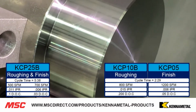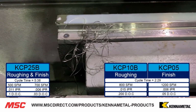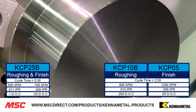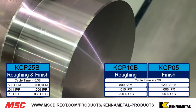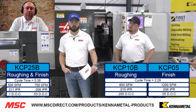When it comes to the finish here, Chad, is this what we would expect from that new school method using the insert we just saw? Yes. Yep, and again, your finish on your old school method and your new school method, you're going to generate the same surface finish, particularly on that OD cut there, because you're running a 2 nose radius, 31 thousandths nose radius, and you're feeding it at 6 thou per rev, which those two aspects are really what control your surface finish.